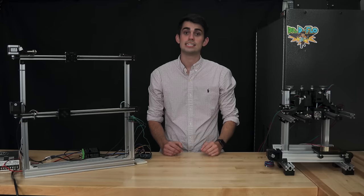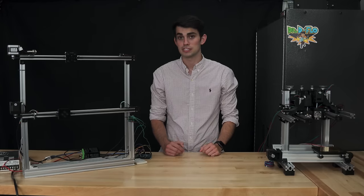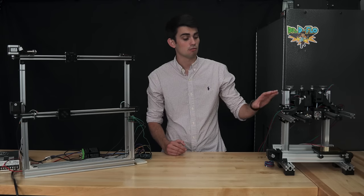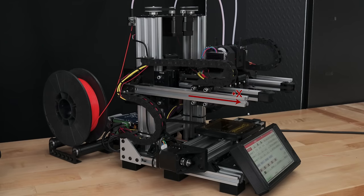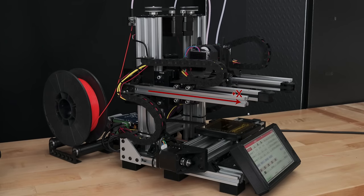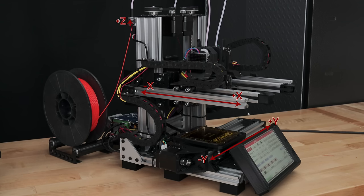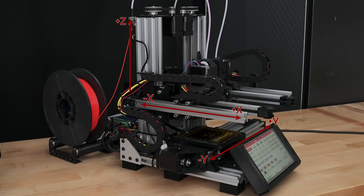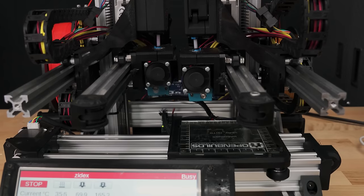The 3D printer needs a reference location, known as a home, to base all of its subsequent movements on. To define a home location, it's important to start visualizing the linear rails of this 3D printer as axes of a 3D graph, with each axis having a positive direction ending in a maximum and a negative direction ending in a minimum. For simplicity, let's say this home location is at the minima of the X, Y, and Z axes, or 0, 0, 0. When the power is turned on, how does the printer find these minima?